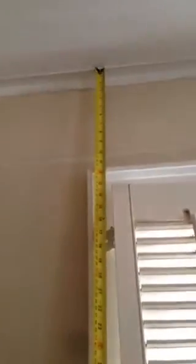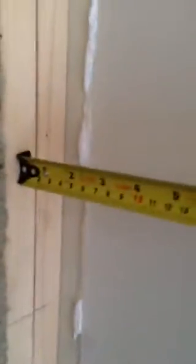This is the detail on the far right corner. Right now we have 105 inches from the ceiling. On top of our casing is 11.5. There's going to be a 1-inch, half-inch plywood, half-inch drywall going onto this wall. And right now we have 16 and about 16 3/4, 17 on the top. But if we use 16 3/4 for a measurement, 16 3/4.